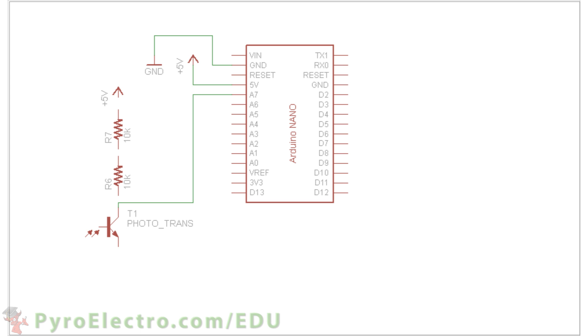For the hardware schematic, we'll use the Arduino Nano with its plus 5 volt and ground connected to the breadboard's bus lines. Analog pin 7 will connect to the phototransistor's collector pin, which will be connected to two 10 kilo ohm resistors in series going to plus 5 volts. The phototransistor's emitter pin will connect directly to ground. The infrared LED will connect to plus 5 volts through a 470 ohm resistor and to ground, meaning the infrared LED is always on.